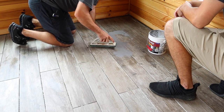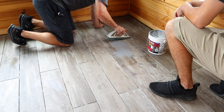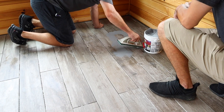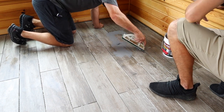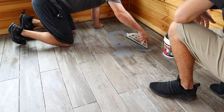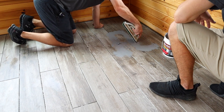When I said 20 square feet, that's like four by five — just right here. Keep it a relatively small spot because you will need to wipe all this off. This epoxy grout will dry extremely fast and start to flash off because it has polymers and things that make it dry extremely quick.